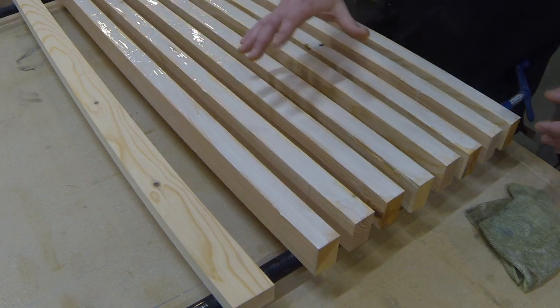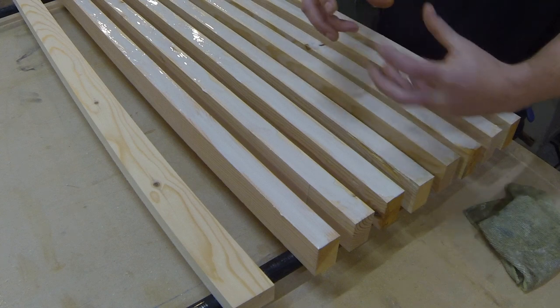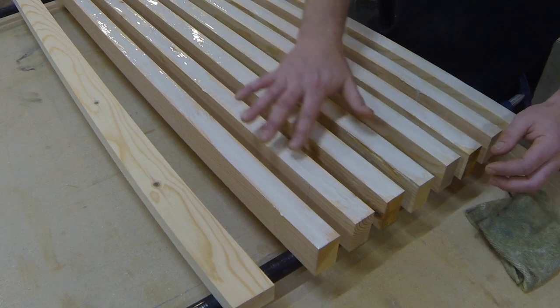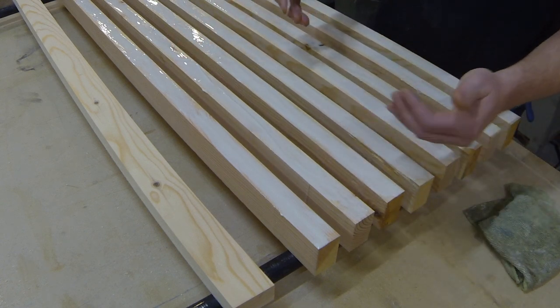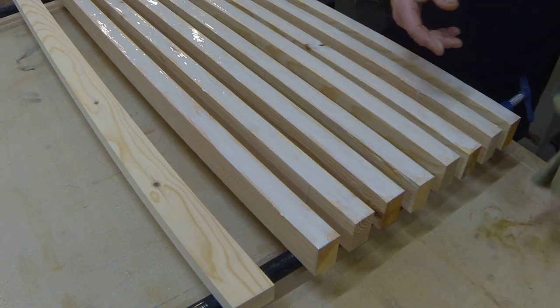What you're noticing here is I'm moving around with my finger, trying to leave it a little mounded in the center — it is going to squeeze out as I compress the clamps. As long as you get a good coating and you don't want it so thin that you can see the wood through it. I'm only doing one side on these edges, so I want a generous amount of glue on there.